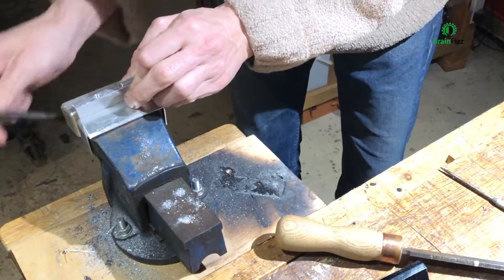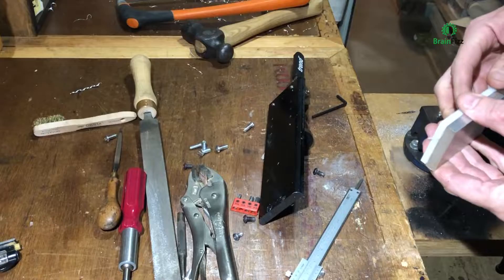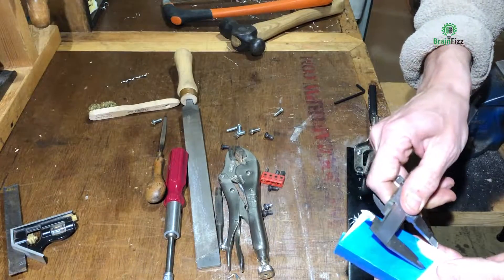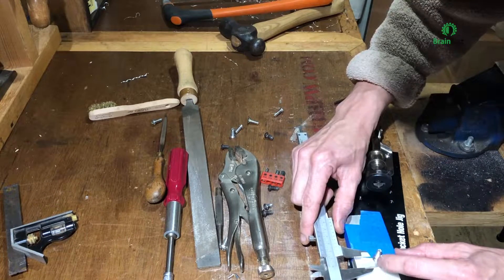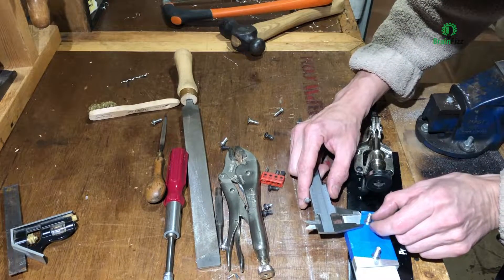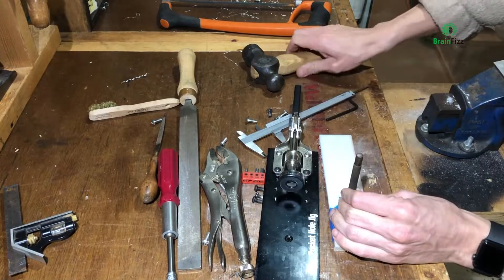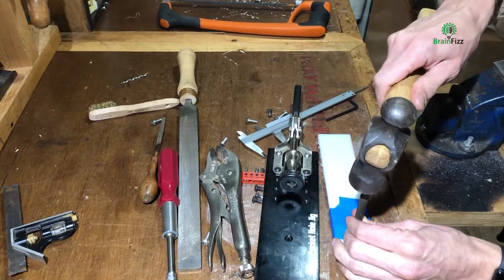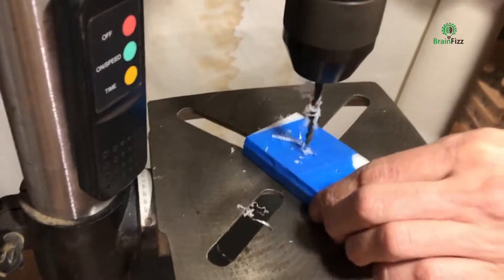I double checked that it fitted and just where the bolts were going in, I burred off the top there. A little bit of draw filing just to take the burrs off and smooth that edge down and allow it to sit flush on the old base. I then cut a piece of high density polyethylene to the same width as the flat bar and taped the two together so I could mark out two mounting holes to screw the plastic to the metal, and then another hole in the plastic to allow for the little pointy writing nibs of the pen so they don't get damaged.